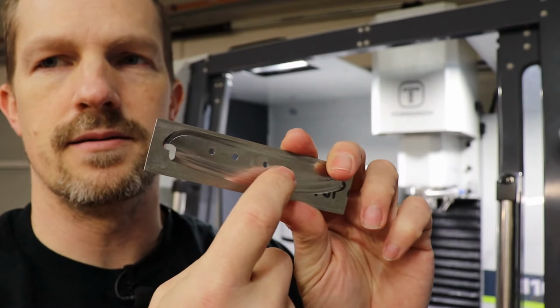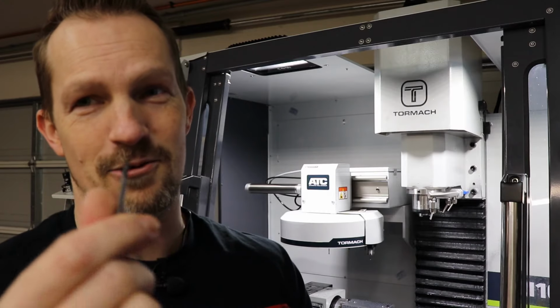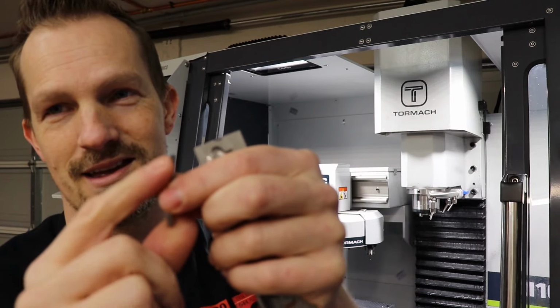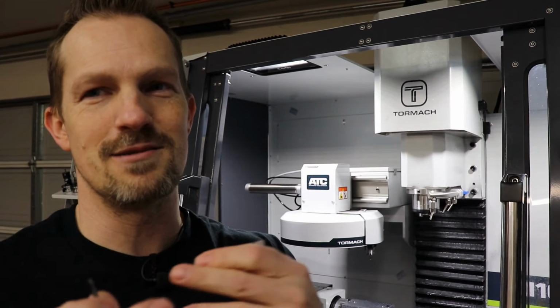One thing that's interesting to note about these holes that I'm using here, I used the drill to drill these to size, partly because the 1/8 inch end mills aren't actually 1/8 of an inch. An 1/8 of an inch is 0.125. And 1/8 inch end mills, pretty much all the ones that I've ever seen, are actually 0.1235 diameter for whatever reason. Something about the way they grind them, but no matter what manufacturer or what type of end mill it is, it seems like they're always the same within half a thou or so. So the drills, though, for some reason, are exactly 0.125, at least the ones I've been using. So if anybody knows why that is, let me know. But that does mean that in your CAM software, you need to program your 1/8 inch end mills to actually be 0.1235. Otherwise, you do run into some tolerance issues.